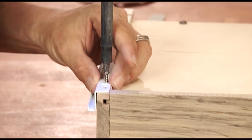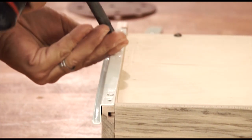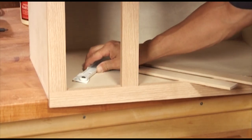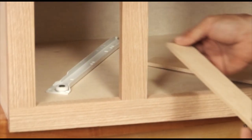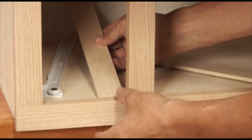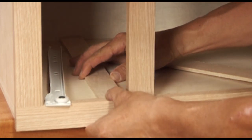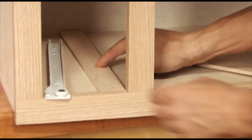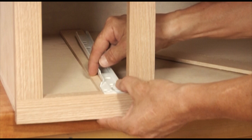With the drawers assembled, I can install the drawer half of the slides. They simply screw to the bottom of the drawer, flush at the front. Now I need to put the drawer glide inside the case. In this example, the side is offset from the face frame, so I need to make some fillers. This is a quarter inch — I'm just able to use some quarter inch plywood, but you'd want to mill it to whatever thickness you need. That can be installed with double faced tape. When we install the glide, we'll screw through the filler strip into the side of the cabinet, and that will secure it permanently.